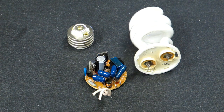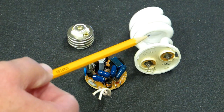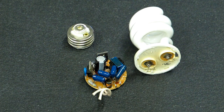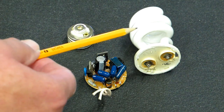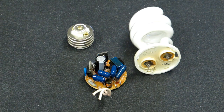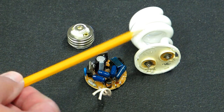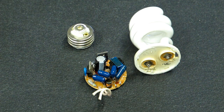These were originally fairly cool or blue in color, but they've improved the light to where it's warmer — more consistent with what we expect from an incandescent bulb. The only difference between this and the long straight tubes you're accustomed to in a house or office is they've made them smaller in diameter and curled them up so they'll fit into a light fixture or table lamp. They've also improved the phosphors, the efficiency of the ballast, power consumption is less, and the lights come on quicker. So they keep getting better.